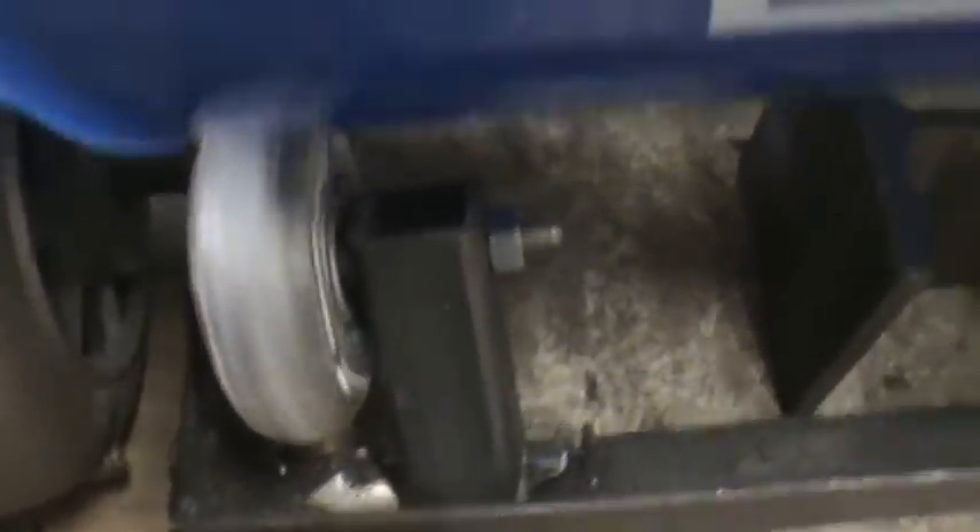The first tumbler I made used a motor that runs a skate wheel via the shaft. I even machined a little piece on the lathe to run on the skateboard wheel — the motor turns the wheel, which in turn would spin the bucket. It worked okay with a very light load of pins, brass, and water, but when I really loaded it down, the wheel would spin but it would not spin the bucket. Even trying to do it by hand to coax it, it would just sit there — the bucket would not turn.